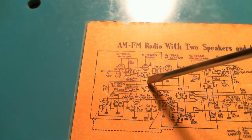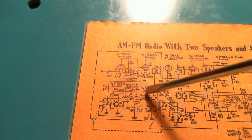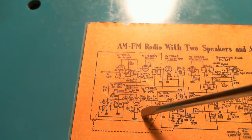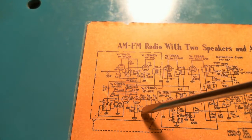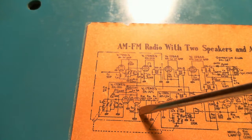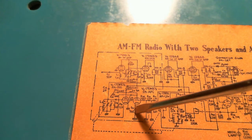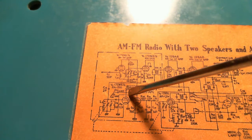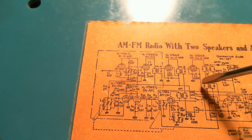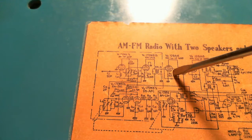What about a cathode resistor? Well, a cathode resistor could do the same thing. So there's one there. There's one there. Cathode resistors take a beating sometimes, especially in the output tubes. These tubes don't conduct very much current, so generally the cathode resistors don't get beat up too much. So that resistor, that one, I think they all qualify as potential suspects.